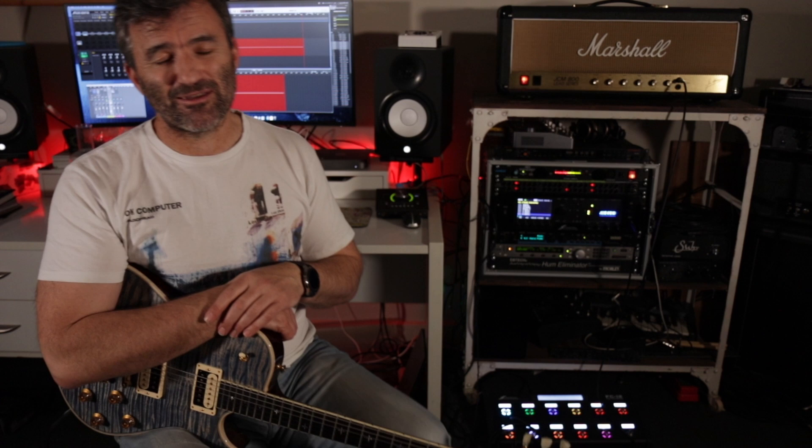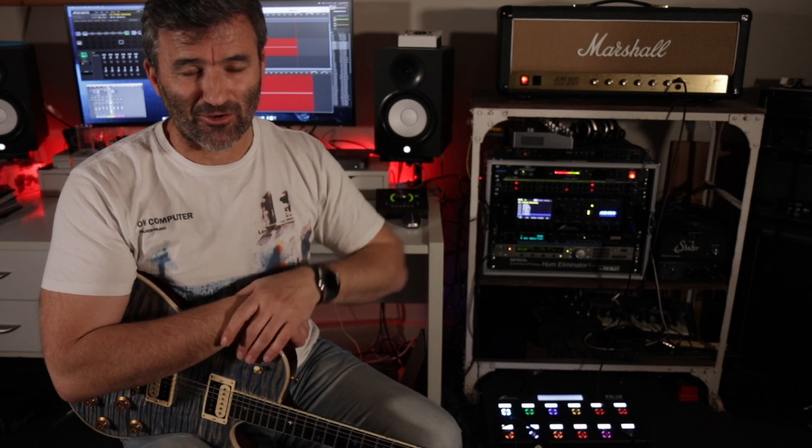What you heard me playing in the intro is the amp biased correctly — it sounds like a killer 800 now. In this video, we're going to look at the impact of bias. I want to talk about what a cold biased amp sounds like. We'll do a test of the amp when I first got it, and you'll hear crossover distortion — where you get cut off in the power tubes, so they're not conducting all the way through the cycle, giving you a really horrible thin sound. I'm going to take it to the bench, show you the bias problem on the oscilloscope, and you'll see the visual impact of what happens when the amp is very coldly biased.